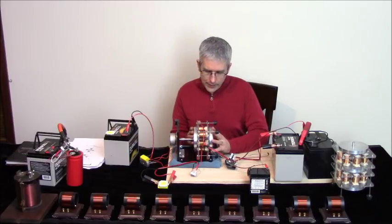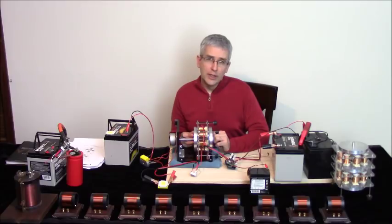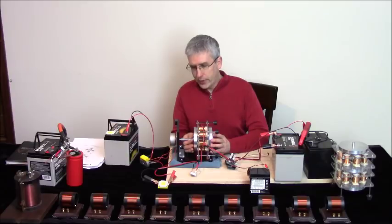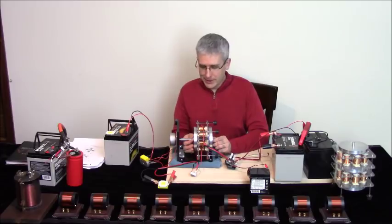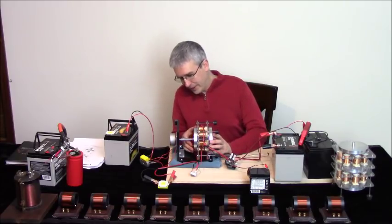So, okay, what we have is bigger magnets. We've got over a half inch rotor, so it's really a lot of flywheel mass here on either side. It adds 2 pounds to the whole kit. It used to be 5 pounds, now it's 7 pounds. So 3/8 inch shaft, before it was a 5 millimeter shaft. I was trying to go European style with the millimeter and it was a big mistake. So I went back to American.